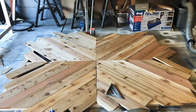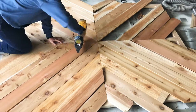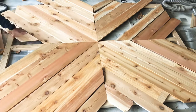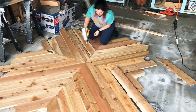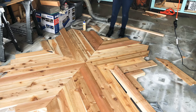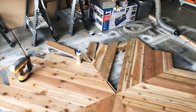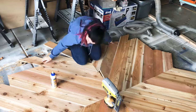I normally just do a quick dry fit as I'm cutting each piece to make sure everything fits and goes all the way to the edge of the frame. Then I take my Titebond glue and glue and nail along the middle boards and wherever the frame touches the cedar board — a couple nails each. I'm using one-and-a-half-inch nails and Titebond glue. I have a DeWalt 18-gauge nailer that I use on almost all my projects — I love it. If you don't have a nailer, you can screw or hand-nail the pieces into place. Hand nailing takes a bit longer but leaves a nicer finish than screws might.